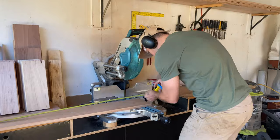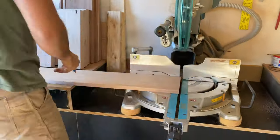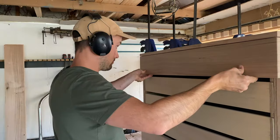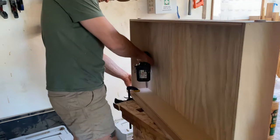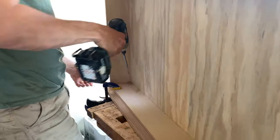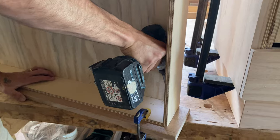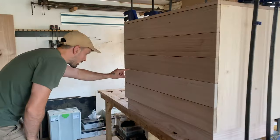Now that your top and sides are in place it's time to add your drawer fronts. It's always best to measure at this stage before cutting in case your measurements have adjusted slightly throughout the build. Place your first drawer front into place and clamp. Measure, mark, countersink, pre-drill and screw your hardwood to the drawer carcass. Repeat this step adding one drawer on top of the other until you reach the top drawer.